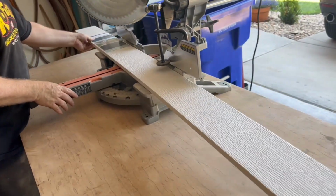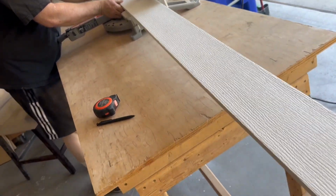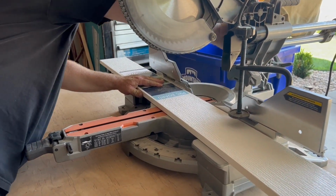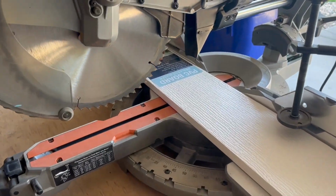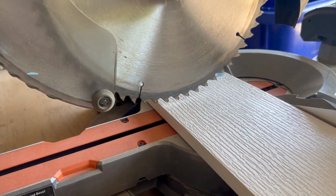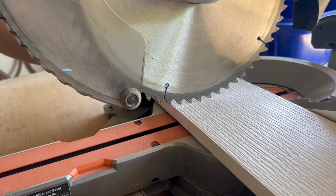So I did go get some PVC trim. Figured it would add some water resistance to the lowest piece there. And paint and caulk will do what it does for all the rest of it. I don't want to retrim the whole house, but those bottom pieces that did need replaced, I did go spend the extra little bit to get PVC trim.